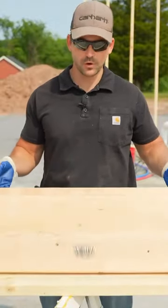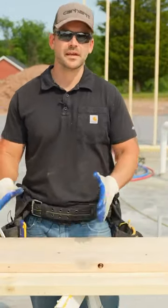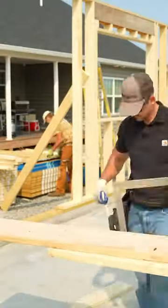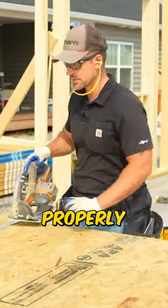The next header I'm making for this wall is going to be made out of 2x12s and it's going to be three ply thick. It's a little overkill, but since the 2x6 wall I had to add another ply to it. I'm now going to rip this sheathing down to fit in between the header, which is just going to keep it spaced out properly for the wall.